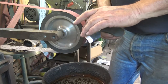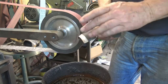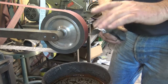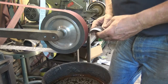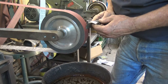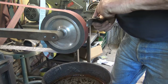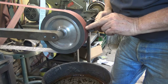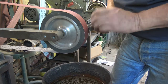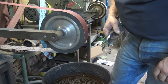We've got a nice hollow ground on here. But in the long run, I don't want a hollow grind on an adze — an adze needs to follow a curve, and a hollow grind only contacts at two points, which isn't as well-supported a cut. But it really helps me index it in this next step. With a fresh 120-grit belt I can put this right on the edge, look down it, and get a nice flat grind. I can see that I'm following the bevel and staying flat, and I'll also be able to see a little burr coming up. This actually has just the slightest burr from the 60-grit belt. Once I have an even grind line with 120 and a burr on the inside, it'll be time to go to a 220 or 240-grit belt.